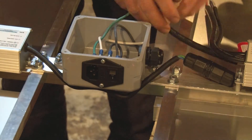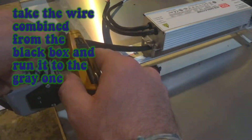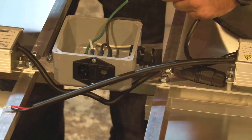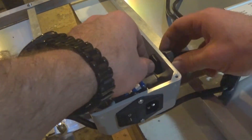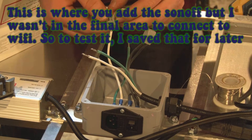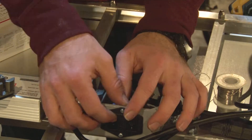The only thing I didn't like and couldn't figure out a way around was that the driver in the back with the extension had to just be pushed around the project box. Then I take another extension wire and run it from the black driver's junction box over to the main brain box, remove the rubber insulation on both sides, and connect to the rest of the wires. After stripping the wires is when I would connect to the Sonoff, but since I wasn't in a growing location and couldn't connect to their Wi-Fi, I just wanted to test the light. I put two-port Wagos on so I could plug it in and make sure everything functioned correctly.